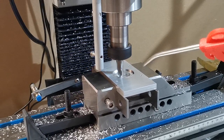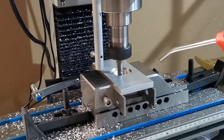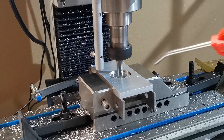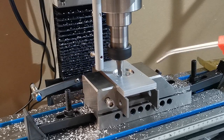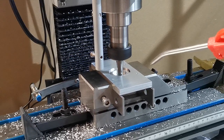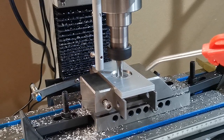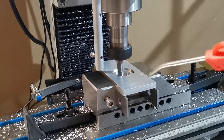This is going to go down to about 10.2 millimeters to make sure it goes past the bottom of the cutting edge. The reason we've gone a little bit deeper is basically so that the side cut is not on the tip — we're trying to even out the wear across the tool.